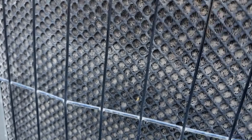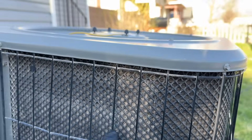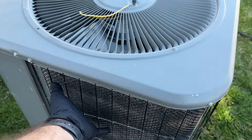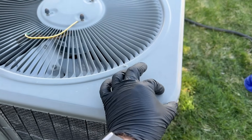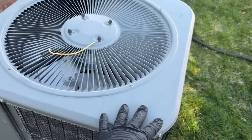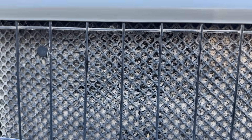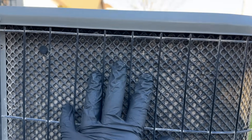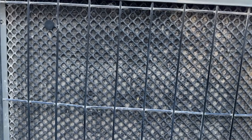I want to show you close up what these coils look like — they're pretty nasty. But even if your coils don't look like this, I'll show you what you can do to gauge how good a clean you're getting. Some units have two rows of coils — one outside and another inside underneath the top piece. I'm going to take this off and show you what it looks like underneath. We're going to shine a light on the back side for a before-and-after comparison, and you can see the difference cleaning the coil makes. Even if your coil isn't this dirty, it will make a big difference allowing more air to flow through those fins.